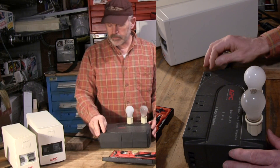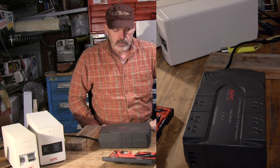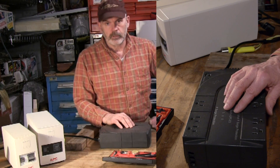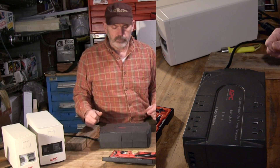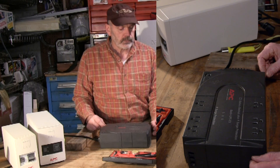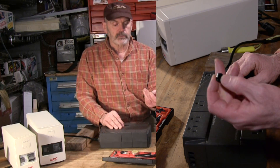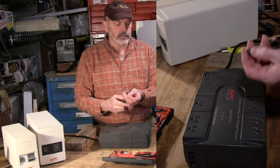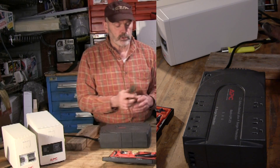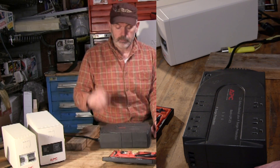Now that I haven't ruined this, I can order a new battery for it and use it to power my alarm clocks. Just to recap: when you take these things apart, make sure it's unplugged and batteries are out. Even better if you let it sit for a few days so you don't have to worry about the capacitors shocking you. But if you're real careful how you handle it, you can do it freshly unplugged. You especially want to make sure everything is unplugged and cooled off — all the capacitors are drained — if you try to snap off the piezo speaker with side cutters. That's how I ruined one of the older ones: it was just about ready to come off, something shorted, I heard a little buzz and that was it. I got this one for free off Craigslist, so if I'd screwed it up it wouldn't have been too big of a deal.